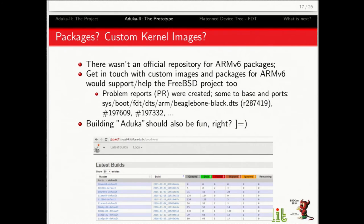We had stuff on it, but then when we started using the I2C, we kind of found a flaw in the, I don't know, in the system. I don't know how to say this. We found a flaw. We couldn't use the I2C. It wasn't available. The pins were not enabled to use it. So we contacted the team, and Gonzo was the one who fixed it, and we were able to use it, because I2C one is used only by the board itself. We cannot use it, so we need another channel enabled. The same thing we had with serial, that we could only use the zero, not the one.